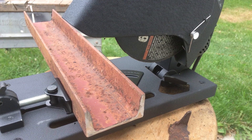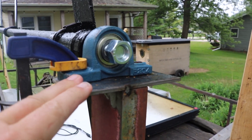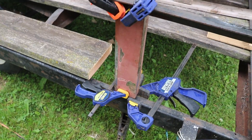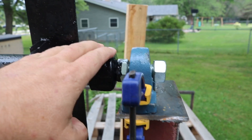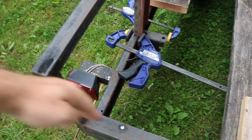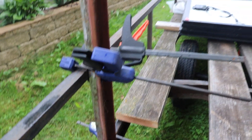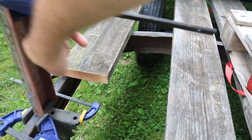On the other end of the trailer, I cut a section of channel to length, tack welded a plate on the end so it wouldn't fall off, clamped the other bearing in here for support, and have this temporarily clamped in place. I'm going to have to scoot it over a little further and decide exactly where I want it to go based on the length of the mount, then weld it in place. The bigger concern was on the far end — over here if I grab this and shake it, you can watch that flex. So I'll definitely need to do some sort of cross bracing on this end. There happens to be a mount right at the base, so I think I can put a cross piece out to the other side and then do diagonal cross bracing right here.